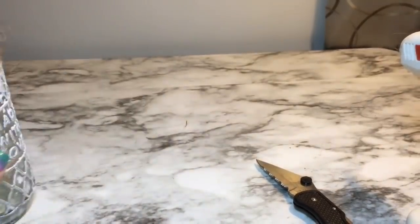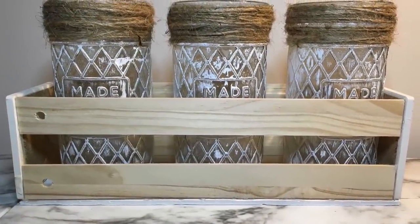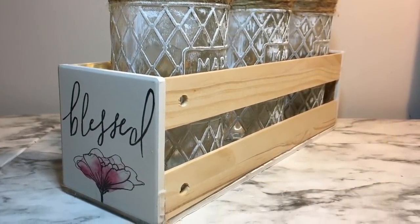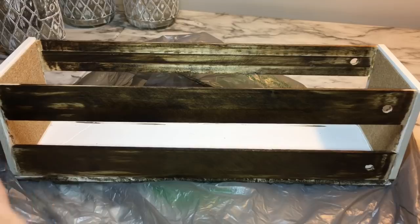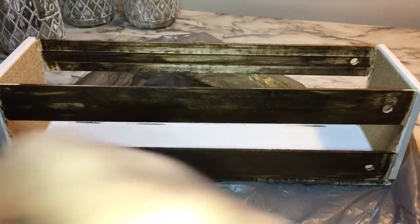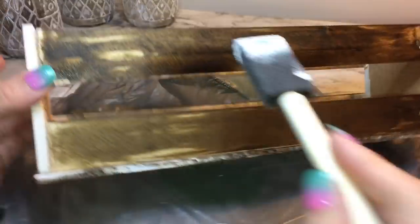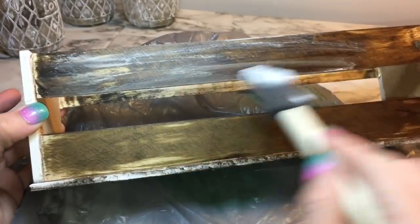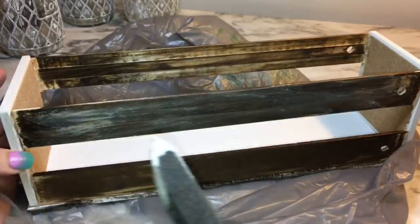I love the way it looks — it's really farmhouse style to me. This is what the box looks like if you wanted to leave the wood rulers in the natural color. I decided to go ahead and stain and paint them. I stained the rulers with a dark chestnut stain, then I'm going to take that same foam brush and put a little bit of chalk paint on while the stain is still a little bit wet, because then it kind of mixes with the stain and gives you this weathered look. You just take that white paint and brush it on over the stain — just a dry brush — to give it that white wash and that weathered look.